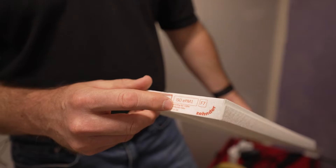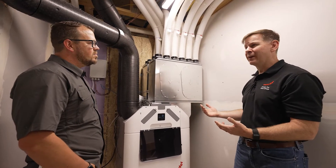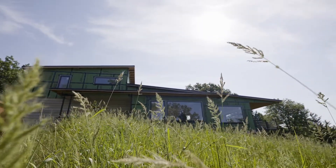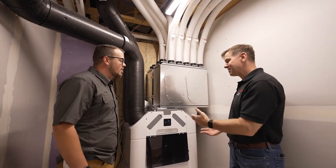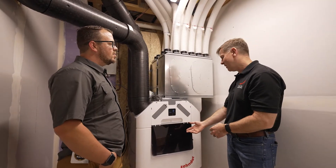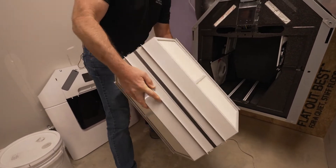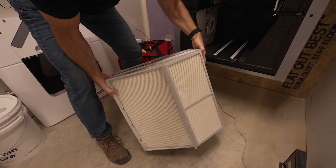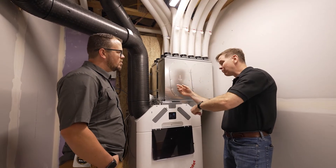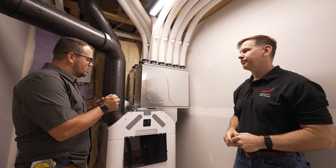The air is filtered so it's less contaminated than indoor air. On a day like today — supposed to hit 95 or 100 — we've spent energy cooling this building and don't want outdoor air spoiling that. So the last thing we do inside this unit is a heat exchanger, or in this case an enthalpy exchanger. That allows the outgoing exhaust air to capture heat from the incoming outdoor air, haul the heat and humidity back outdoors, and deliver fresh air to the house through our distribution system.